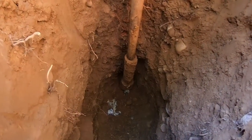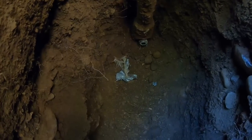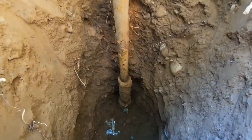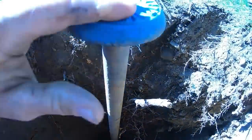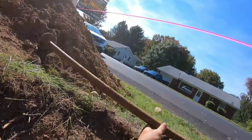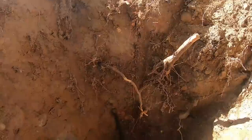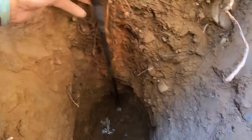Alright, down here at the curb box — got everything cleaned out, pulled away the duct tape they had on there. The reason I'm making this video is nobody ever shows this part when hooking up a waterline. This is the curb box right here — this piece just pulls out and this is what you spin. It's adjustable to grade — slides in and out. If your grade is six inches higher you can adjust it, but this is the key that turns the valve inside here.